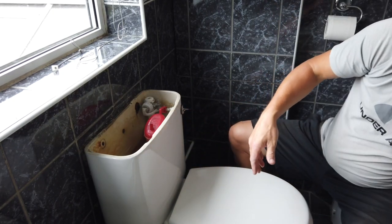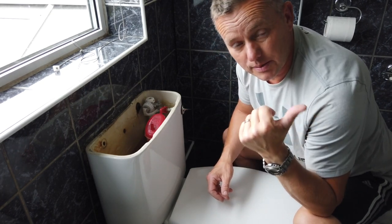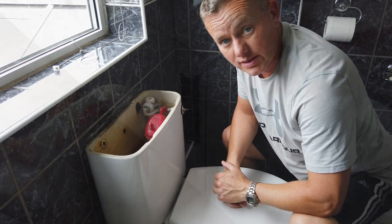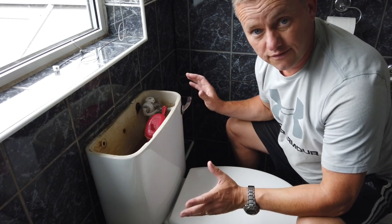I've put links in the description for a new system — if you've got the old one and want to replace it, you can get all the bits from the description below. Now we've got to switch the water off. I'm going straight downstairs to the main inlet for the house. You might have an isolator valve on your toilet system itself, but sometimes if they've been there a long while and you do turn them, they tend to leak. I know the stopcock at the main entry to the house is a good one, so I'm going to switch that off.